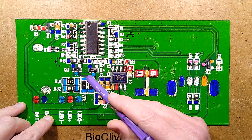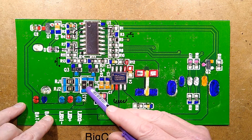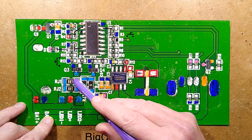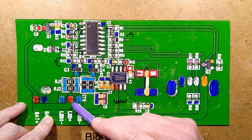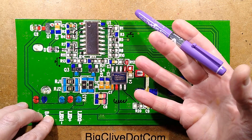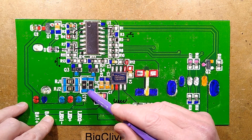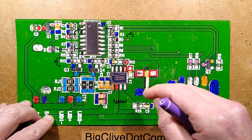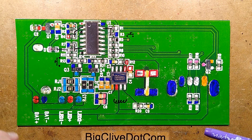I think that's too high. I don't like it when they put links like that in — basically it's relying on the impedance of the MOSFETs and the battery to limit the current, and potentially the tracks. The easiest hack is just to cut or de-solder one of the 1-ohm resistors. If you wanted a much lower output for longer-term operation, you could swap resistors over and use a higher value resistor, which would mean high, medium, low would actually be much lower intensities with much longer battery life.